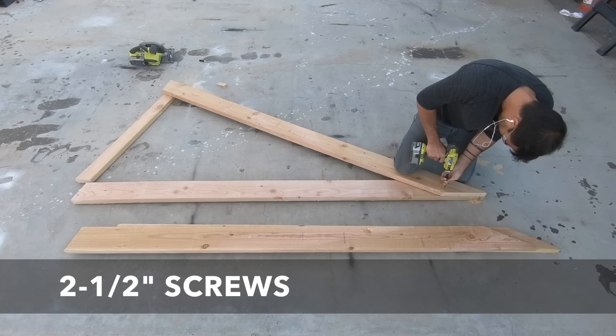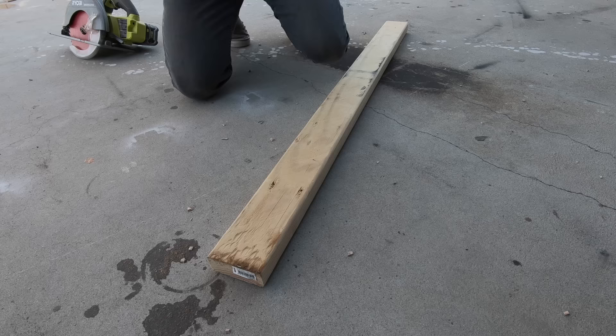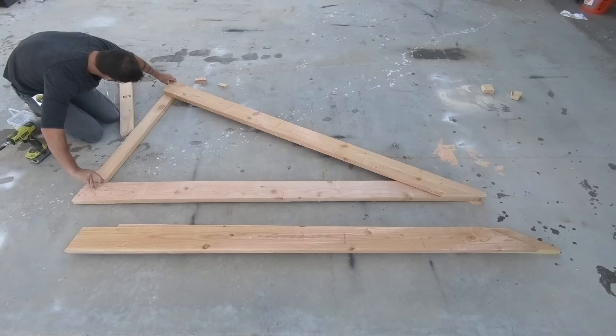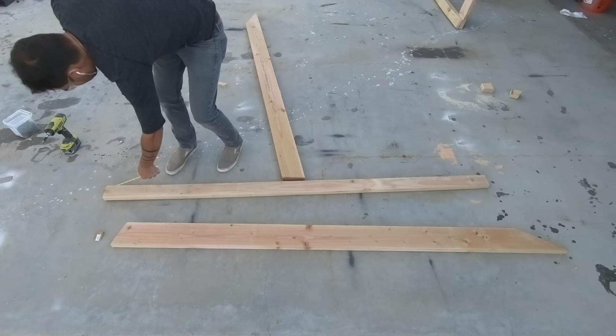You don't really need to trim the other side of this 2x4 piece, but it would look kind of funny if the square end was sticking out. I placed that first piece of 2x4 on a second piece and then traced the angled cuts on either end. I was now ready to finish screwing the first frame together using two-and-a-half-inch long screws, then went through the same process to make the second frame.